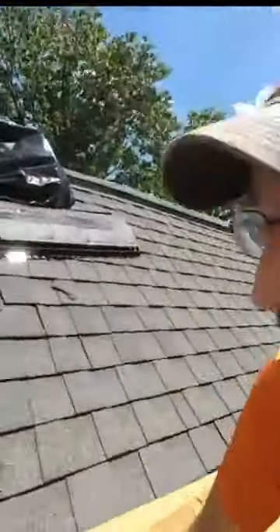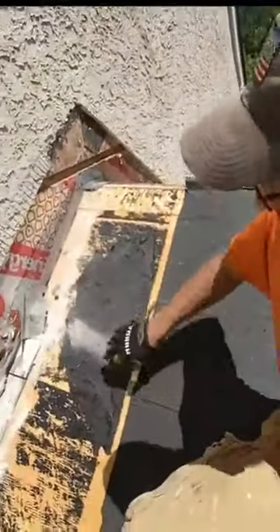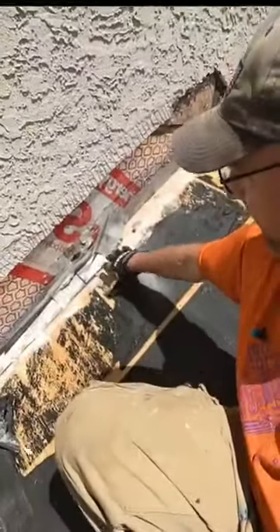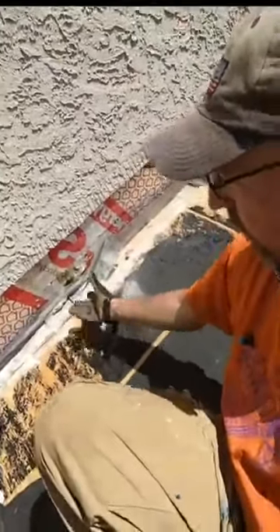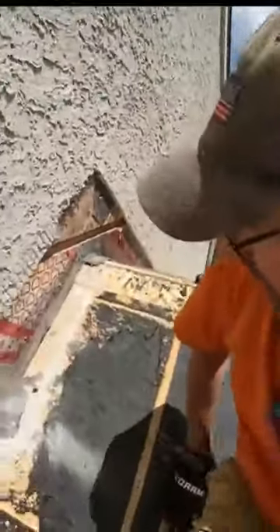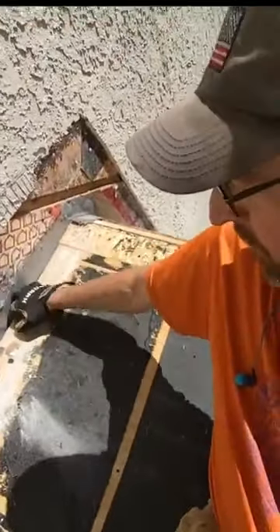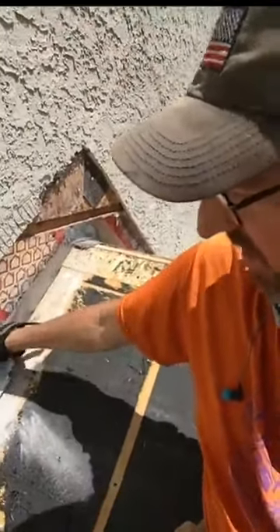So I'll take you up the roof here a little bit — we've already stripped off the upper layer. What we're down to now is a piece of ice and water shield that they had run down. Tar paper was over top of that. They had the step flashing actually under the ice and water shield, but there was nothing that really made the connection to the wall. There's a big giant gap right here between the plywood and the sheathing, just no solid connection here.